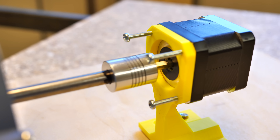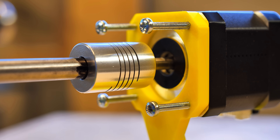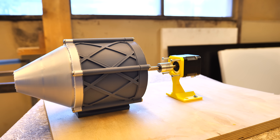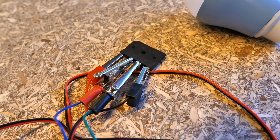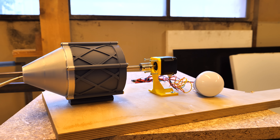So far I have done only dry tests. Now I connected a stepper motor to the turbine shaft, which in this case acts as a generator, and I'm going to test whether it has enough torque to spin the motor. Turbine has no problem handling the NEMA 17 stepper motor. I believe a lot of viewers want to comment that there is no load on the motor — so I connected one 12-volt LED lamp to the motor, with a full bridge rectifier between them that transforms AC to DC current. The result is not very impressive.